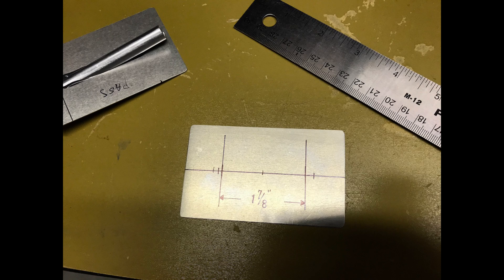In case it helps you, I thought I'd give you some measurements here, but just keep in mind this is the random size that I chose. You can certainly make yours bigger or smaller, but the plate you see here is three and a half inches long and two and an eighth inches tall. I did wind up trimming that down so it's probably about two inches tall now.